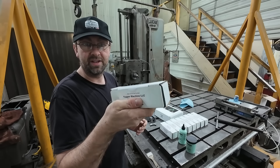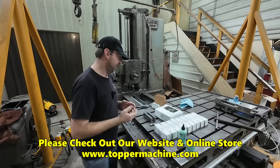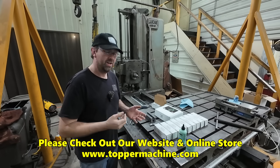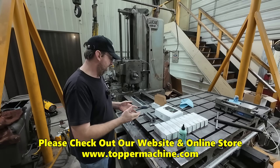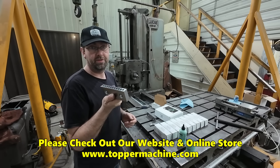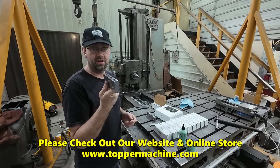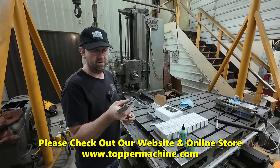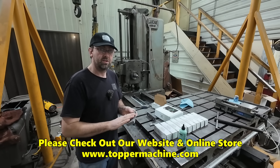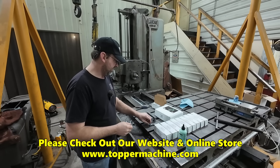I had to give a set to a friend of mine that helped me with the engineering on this and did the drawings — so thank you, Stuart. They're ready to go. These are a 4140 heat treat, so they are a 28 to 32 Rockwell C — a hard jaw. They are machinable yet, but they are a harder material, so you can leave them on your vise as a hard jaw.